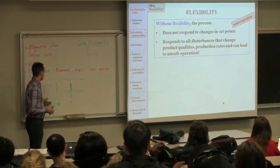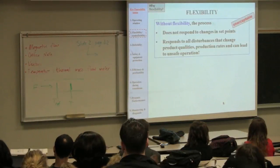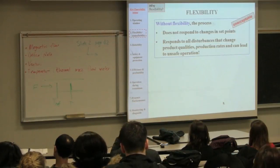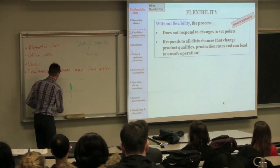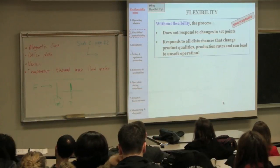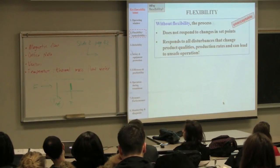Through mathematical calculations and the material properties, we can quickly calculate the flow. The nice thing about this, though it may be more expensive, is that there are no moving parts. It's insensitive to temperature and pressure fluctuations and only needs recalibration against its own internal reference temperature — all you're concerned about is the delta T. The main area of use is primarily gas; it doesn't work well in liquid systems.